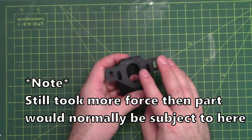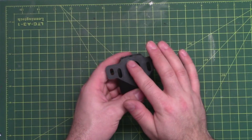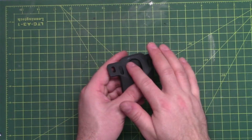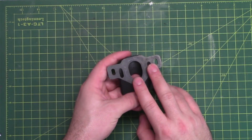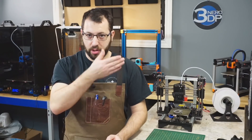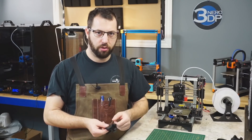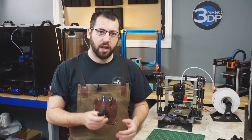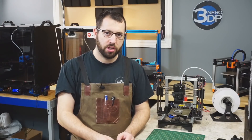If you go back to looking at these prints, you can see that they were printed quite close to the bed. You can even see some of the telltale white stress marks of ABS when it was popped off the bed. These come off really easily if you just hit it with a heat gun for a few seconds — they're just stress marks. This print was printed relatively smooshed into the bed. With ABS, it does like a little bit of smoosh, unlike PETG for example, where you kind of have to lay it onto the bed. So don't be afraid to smoosh it into your bed a little bit more than you're used to if you're having layer adhesion issues. Dropping your nozzle offset and giving it a little bit more smoosh can help a lot, especially if you're having issues with first layer adhesion on some bed surfaces.